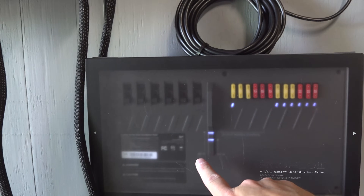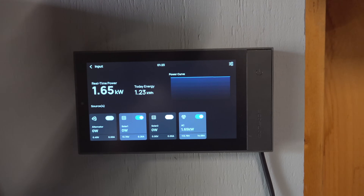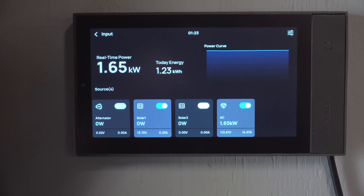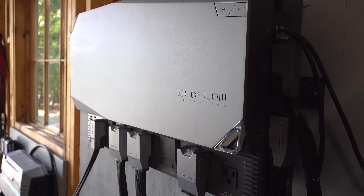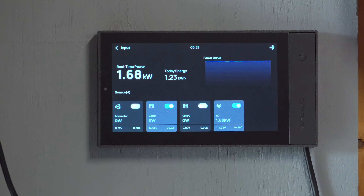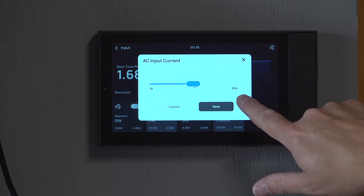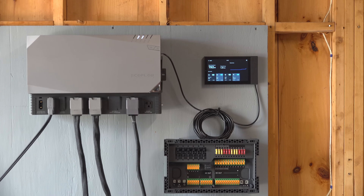You can also see what circuits are powered up and once your system is installed, you can see everything going on — the amount of power going in, what's going out, and the history of what the system has been doing. One example of how customizable this system is: here I'm charging off existing AC power, and since circuits in my shop are only capable of putting out 15 amps each, I can set my charging to 15 amps so it won't blow any circuit breakers. But if you're in an RV, most parks can give you up to 30 amps, so you can easily just change that slider.